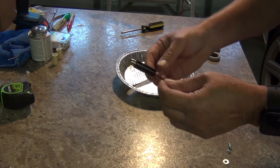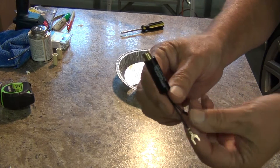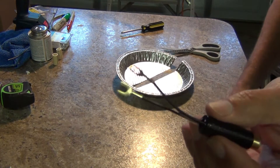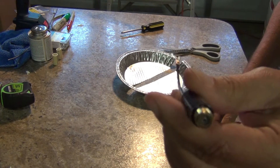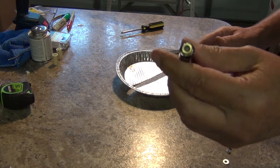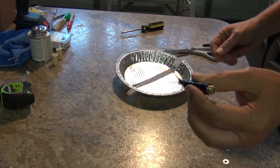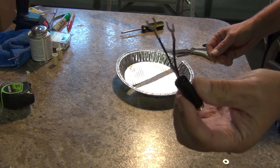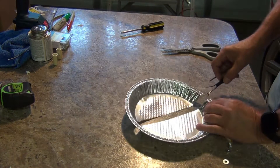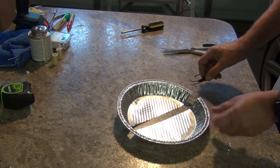This is a matching transformer, or a balun transformer, and it's used to convert a 300-ohm connection to 75 ohm. In most cases it's going to give you a much better signal than just trying to solder on. These are available online — I picked up three of these inexpensive ones for less than $10. Next thing we have to do is just attach this so that we can make this into an antenna, so it's going to go right here.